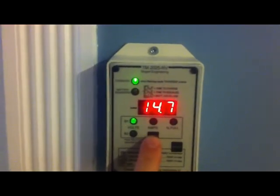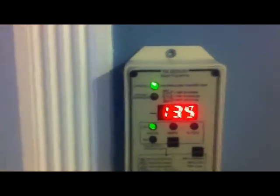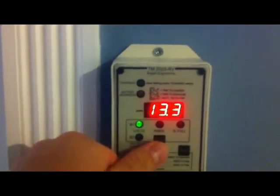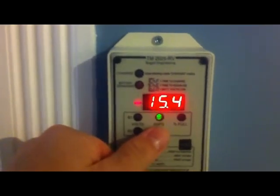That's my voltage right now. My voltage — it must be in divert mode right now. My thing is set at 14.4 in my charge controller, so it goes into a divert and then dumps into a plug-in grid-tie inverter for the wind. That's where it is. So let me go downstairs and I'll show you.